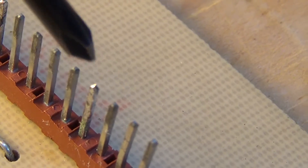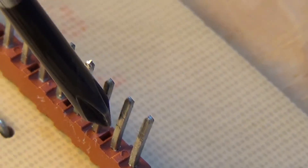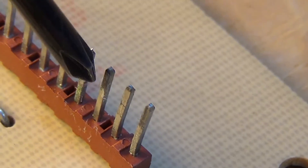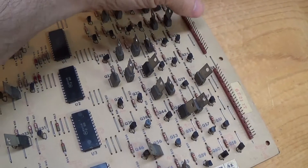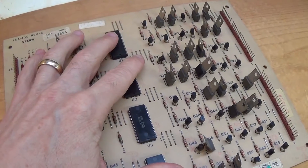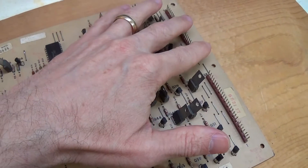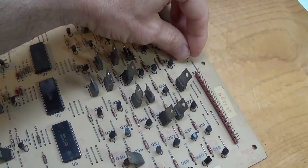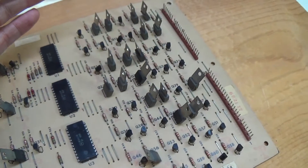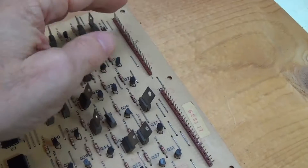You can see that these pins have lost their plating. This is the side where the other connector pin is in contact, so it's constantly rubbing here. These male pins are all degraded. Is this surprising to me? No, not at all. If you've ever worked on these boards, probably about 85 to 95 percent of the time when you have an issue, it has to do with the connectors — some kind of trace, something is not connecting properly. And usually it's some kind of connector. So even if you don't think it's a connector, it probably is a connector. Even if you've proven it's not a connector, at the end of the day, it's still probably a connector.